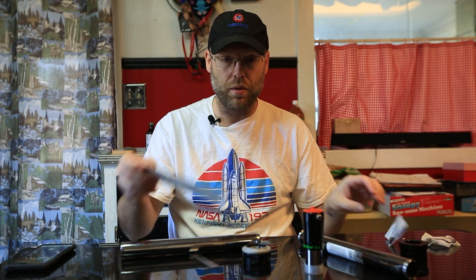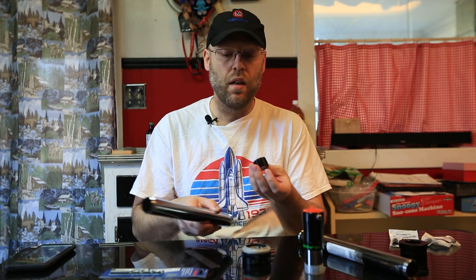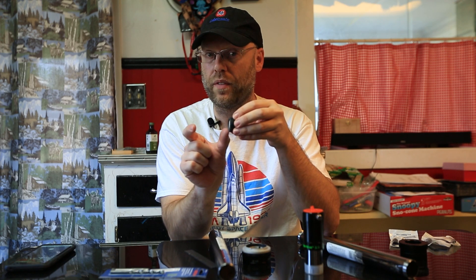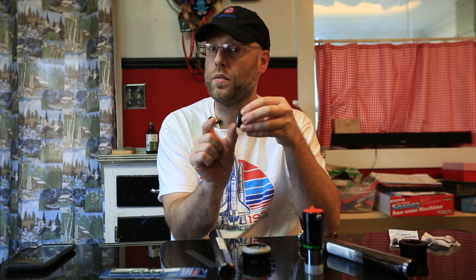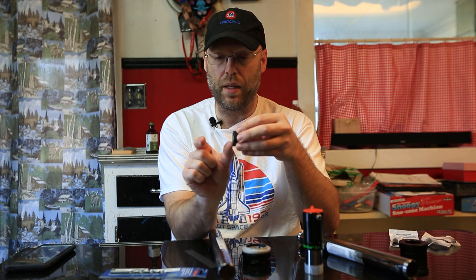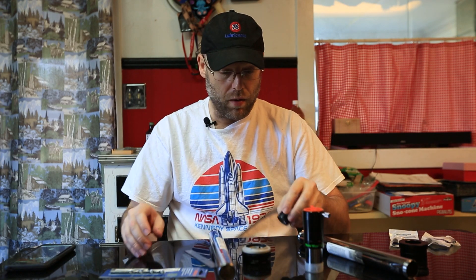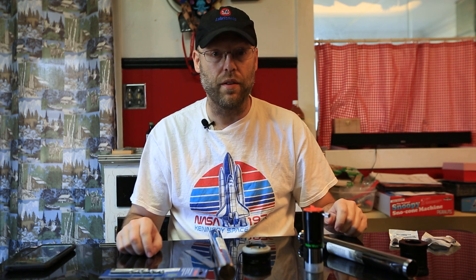As far as how long the tube needs to be: Red says his eyepiece was three inches behind the lens assembly and he got three times magnification. In a camera it's about two inches behind and that gives two times magnification. So I'm going to try to get the camera sensor two and a half inches behind the lens to see if we can get two and a half times magnification — that'll be a good test against the Powermate. I'll go ahead and start assembling these and get back to you when we set up for the night.